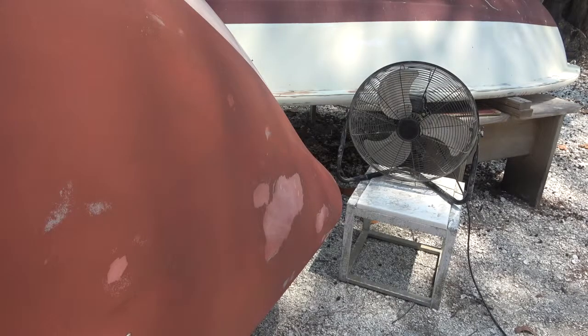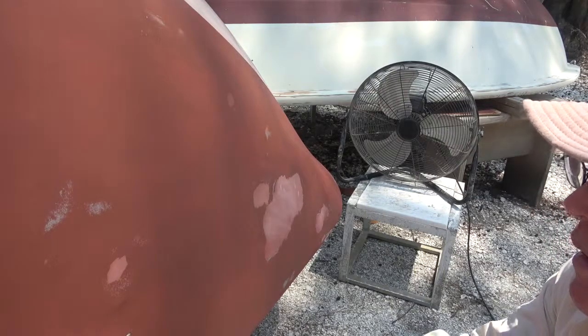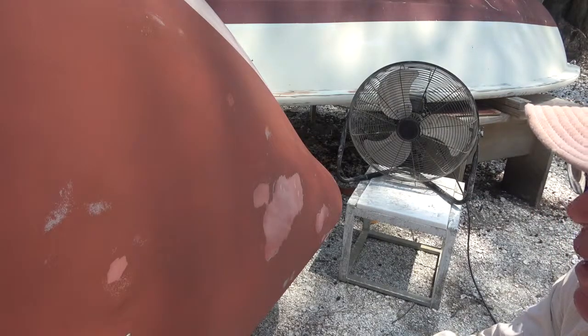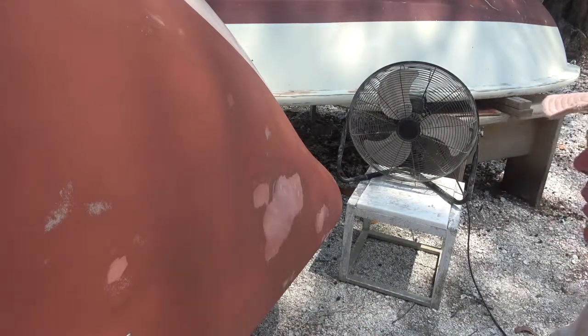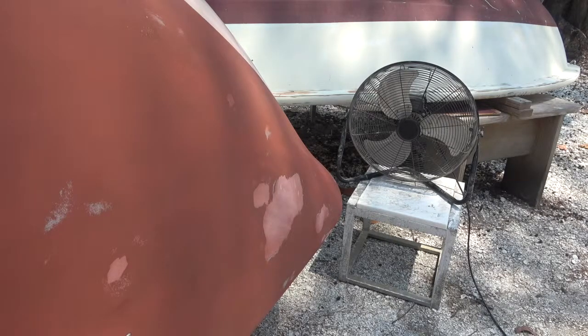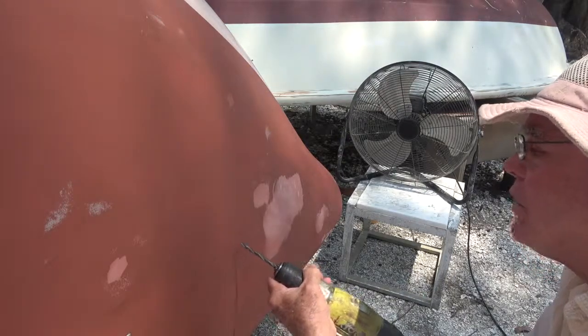And like I said, these cracks, you can see how they get away from you. But once you use an epoxy filler and you open it up good and you have a good etched surface, it does pretty good just to go ahead and patch these things like we're doing. Some more cracks, it just keeps showing up.